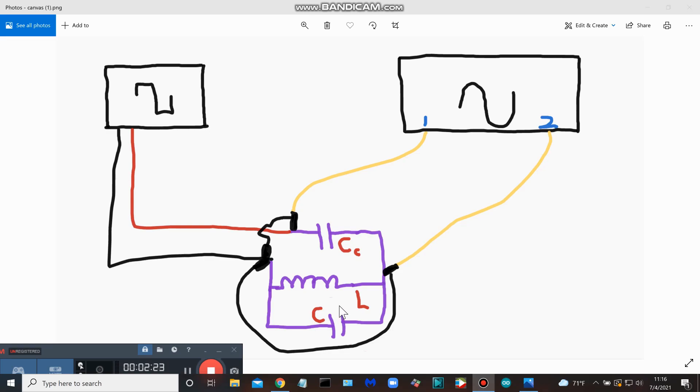We're doing this to establish the correct frequency — we're looking for approximately 4.75 kilohertz for the receive coil for the IDX Pro. To get that you need to change the values of this capacitor. I used a combination of a 22 nanofarad and a 4.7 nanofarad capacitor — remember, capacitors in parallel are additive. That's all we have for today, thanks for watching, more to come.